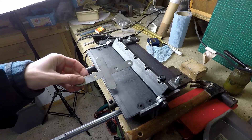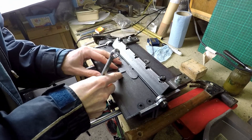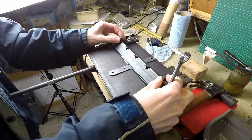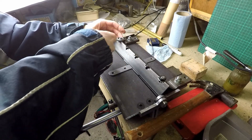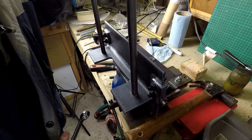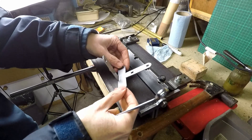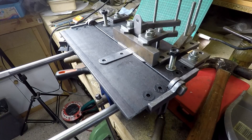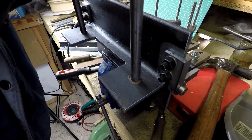This is one of the components cut out and filed to shape, and I'm using my sheet metal bender that I made in another video to bend them up to the correct shape. That's the first bend complete. Because the two bends are close together, I've used some clamps and a piece of steel to guide the bend in the second phase.